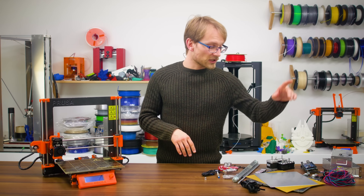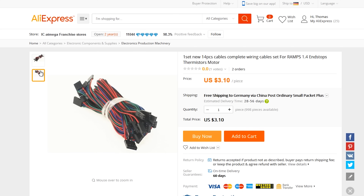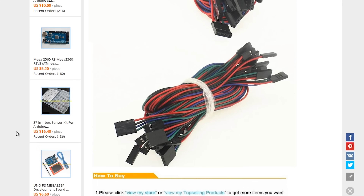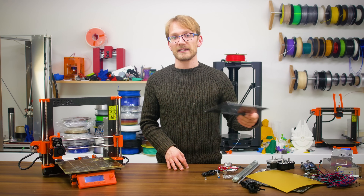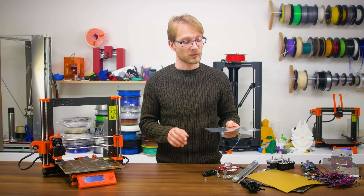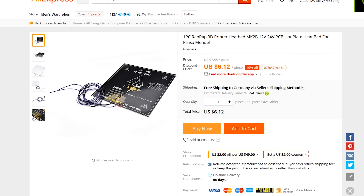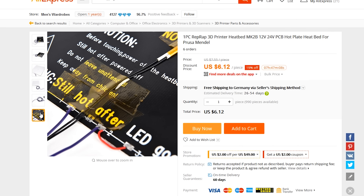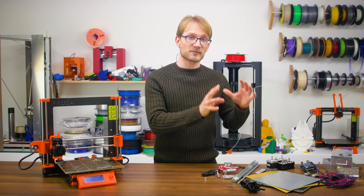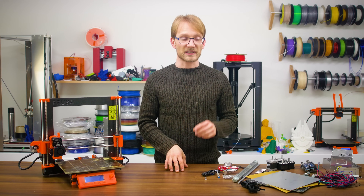I also grabbed a wiring set which comes with pre-crimped connectors for end-stops, motors, and thermistors, and it's really worth those three dollars when you don't have to start messing around with crimping or soldering wires. For the print bed, I'm using an aluminum heated one, since the cheap versions of the common PCB heaters like to flex quite a bit when they heat and cool, which will randomly shift your part up and down during a print. This one for $6 didn't include a thermistor, but you can get a pre-wired one for 50 cents. These aluminum beds aren't always explicitly titled as being an aluminum bed, but the effort of digging through a few different offers is definitely worth it.